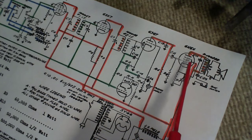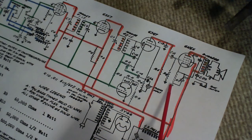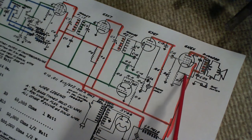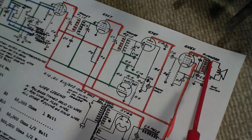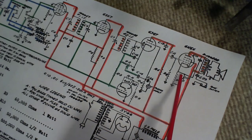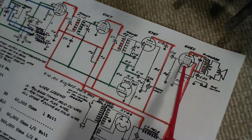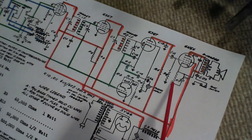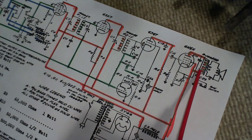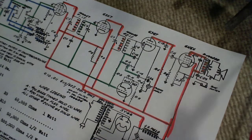The problem is the signal is also flowing right through that resistor. And you know, if you let the signal go through the resistor, then you're going to lose some of the signal, plus you're peeling the, how can I put this? This transformer is feeling the effect of the tube here. If this is a really bad explanation, if there's signal here, it's wasted. So what you do is you put a big capacitor here, bigger the better. They'll put as big a one as they wanted to pay for in the design of the radio here. And that essentially shorts the cathode right to ground. There's no resistor anymore. And now the transformer is getting all it could out of this tube. I'll have to put it that way.